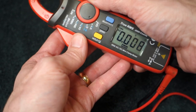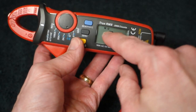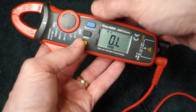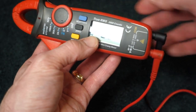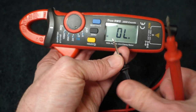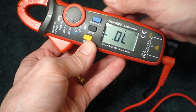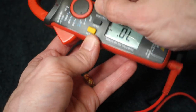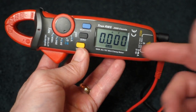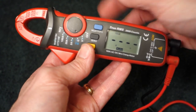Hit it again back to AC. Next in line is resistance — it's auto ranging. We've got the hold function and zero function. This is for the audio buzzer, so if you want to check for continuity. Hit it again and we've got a diode test. And then this is for checking capacitors — a very basic test but it can be useful. Then back to the ohm scale.